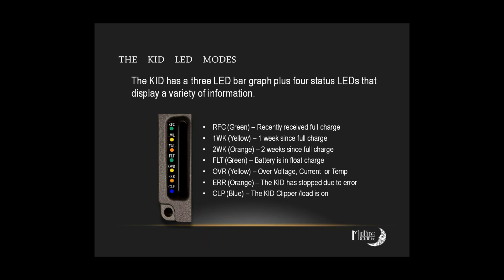Okay. Well, one thing that I can say is, you said it had to be rewired. On a 24 volt system, if you put all those panels in parallel, then you're not going to get anything through, because an MPPT charge controller such as the KID needs about 33% more voltage coming in than your highest battery voltage. I'm going to imagine that those AGMs probably have an absorb voltage of around 28.8. And the 285s, I think you've got an MPP voltage of around 33, times 33%. So you're looking at you need about 44 volts or higher coming in. So if someone made the mistake and wired for parallel, that would be really bad. You're not going to get much of anything through.